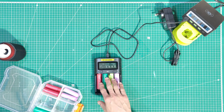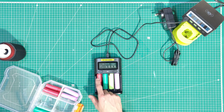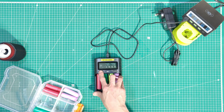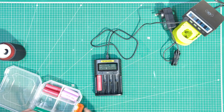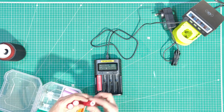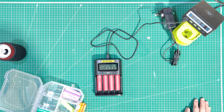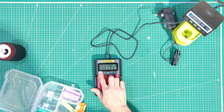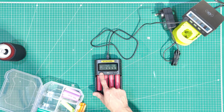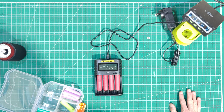That's still good. As they charge up, the internal resistance reading should actually drop. You want it between 50 and 80 milliohms for a fairly healthy battery. I use some batteries up in the 130s, but it doesn't matter too much. Slot 3, slot 4 — that one's really pulling some current. Let's chuck some of the others in and see what sort of current this thing pulls. Readings: 1.3 amps, 1 amp, 1.3, 1.4, 1.3. Internal resistance status: good, average, good-ish, poor. I'll leave these on and just let it do its thing.